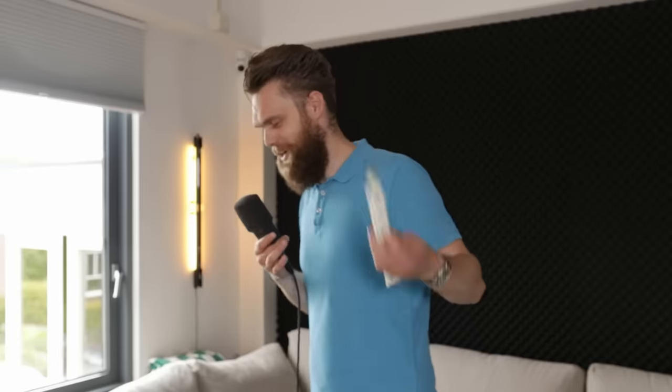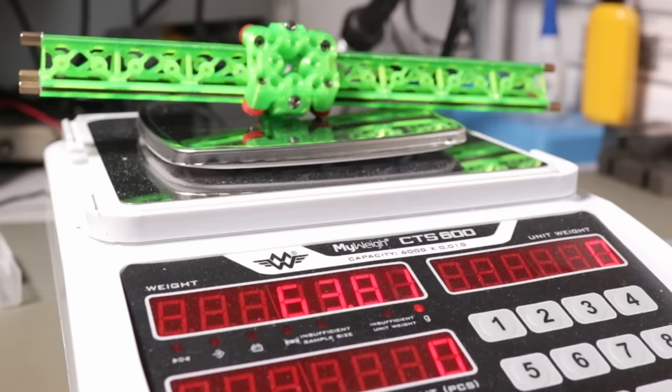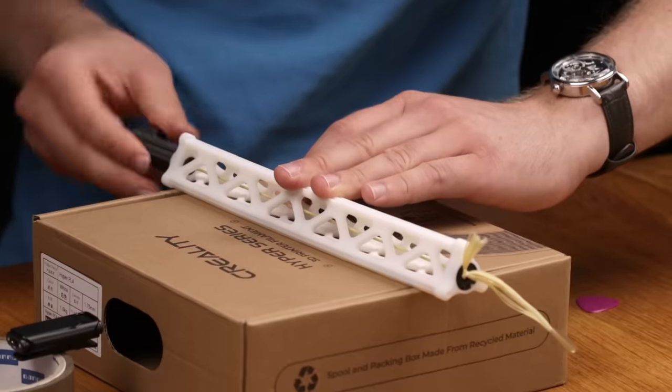But why are we using fibers in the first place and not just a rod down the center? Besides being an interesting thing to try, the initial goal is to turn this into a 3D printer that can print fast. So things have to be light and stiff. It didn't succeed in the initial try, but I think that fibers could be an interesting solution. So imagine this: carbon fiber tubes, and everything is tensioned with Kevlar. That's pretty cool, right?